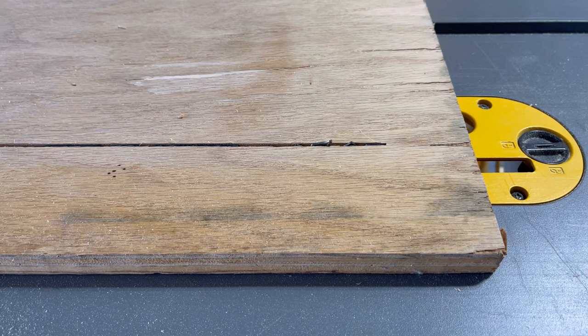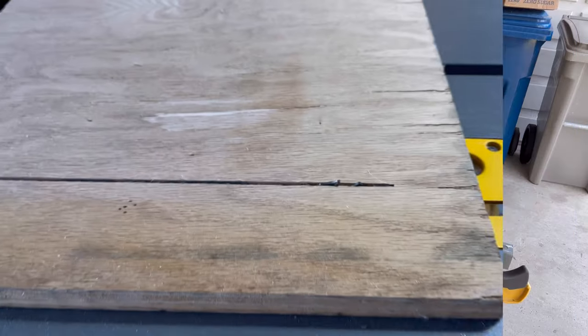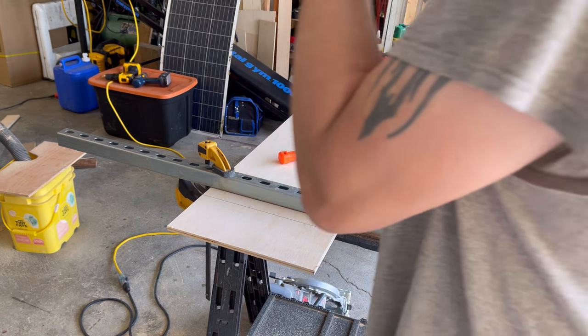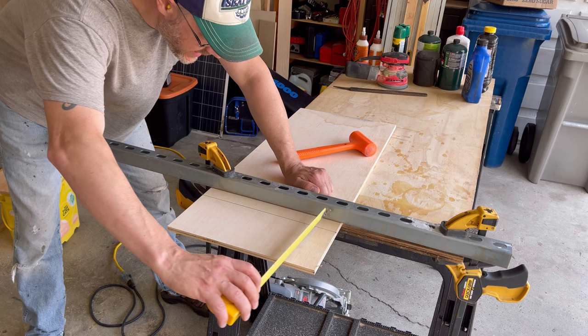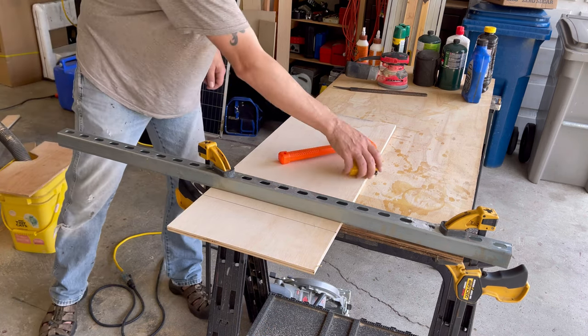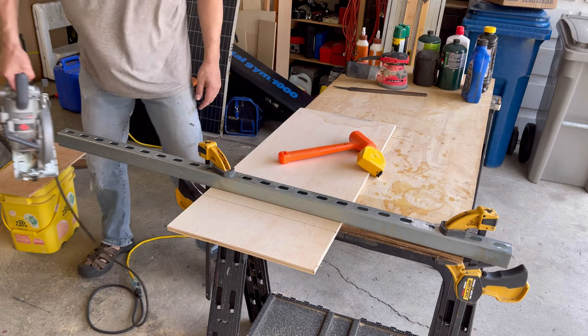He also told me to always follow your work all the way through — I stopped it here just to do a little demonstration. I can't eyeball stuff on the table saw to do a straight line. I don't have a big table, so you just run a fence, go down with some clamps, put it an inch and a half past the line, and buzz it off with the old skill saw.